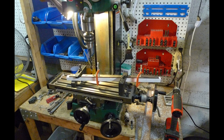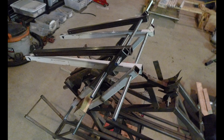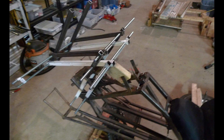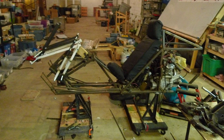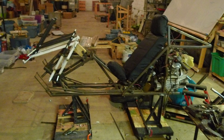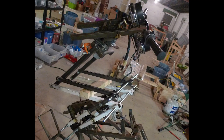The upper pairs didn't have any bends or angles, so I just used the existing bars as templates to drill out the holes in the new one-inch square tubing. I drilled them on the milling machine to make sure the holes are straight. Now both pairs are done — it's looking pretty good. The handlebar mounting bracket, which lines up the bars at the far end, isn't in place yet, so I fabricated that part next using the existing bars as templates. Here you can see the handlebar mount and upper steering column V-block. With that bar mounted, the whole assembly really starts to take its final form.